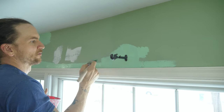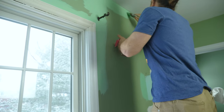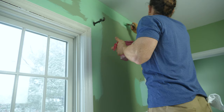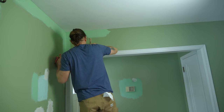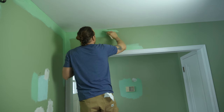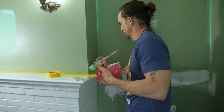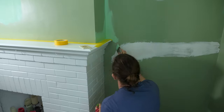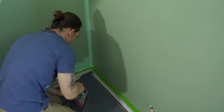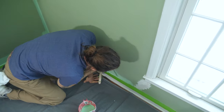I don't tape off the edges of windows and doors because I don't need that extra drop cloth there — I cut those in with a brush. The tops of windows are easy to cut in freehand. But I do fully believe in taping all trim on the floors. It probably takes about an hour to cut in a room like this. I cut in all the ceilings first, then go back and cut in around the fireplace and down to the floor trim.